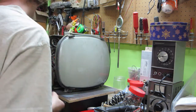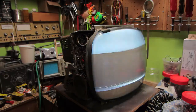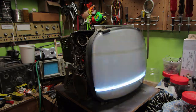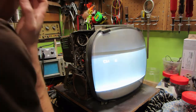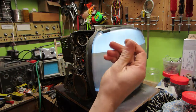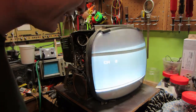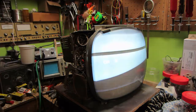Here is a 6AW8 — let's put the old one back in. So I finally got the set going. I found out I had one of my horizontal AFC diodes — which are now 1N4148s — that little orange block — installed backwards. And then I still didn't have any picture after that.